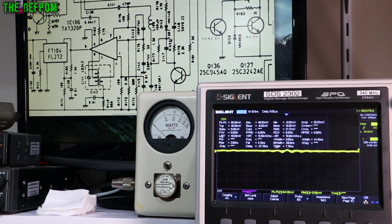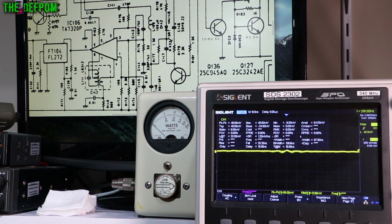So we've got this mixer over here. This is what I need to check next to see if all the inputs appear to be in it. I mean, Q129 was just there, that's what we looked at before. This is where I measured the modulation and the DC offset voltage. So it's doing something. So we need to see what's going on. It's got pin 6, pin 2, 3, 1. Pin 1's not really doing much, I don't think. It's just basically filtering stuff. Pin 3 maybe getting mixed with this.